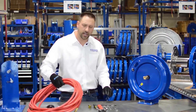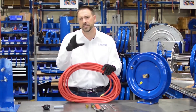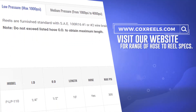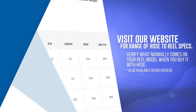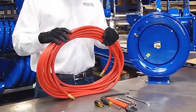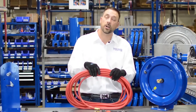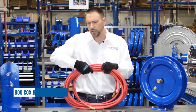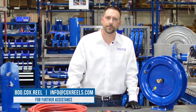Before we get started with the reel, let's talk a little bit about the hose itself. Every reel is designed to work with a specific range of hose, and you can tell what that range is by looking in the catalog or online to see what normally comes on your model when you buy it with hose. If your hose is stiffer, higher in pressure, bigger in diameter, or much smaller in diameter, you're going to have problems with rewind — maybe not enough spring and issues like that. If you're worried, consult the factory about whether your hose will work on that specific model.